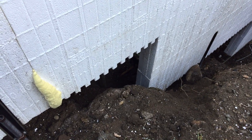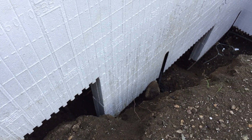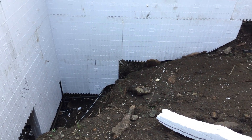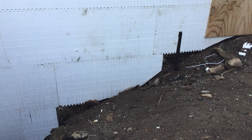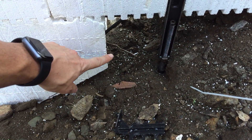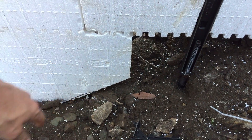This cut-out here — I'll scab a piece of plywood on to keep the concrete from just pouring out of there. There's really no use for that opening, so it's easier to use plywood to fill that gap. Over here I scribed the ICF to meet the ledge as best I could, but you're still left with some triangles because the webs on the ICF don't really start until here — this block would just be a piece of styrofoam with no webbing to hold it together. In situations like this, I'll just scab plywood on as well.